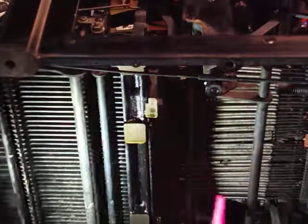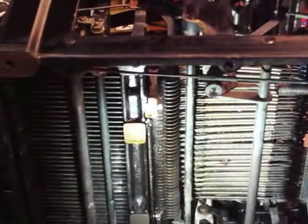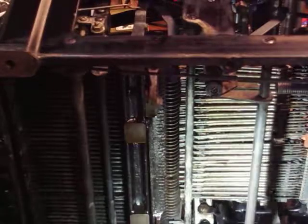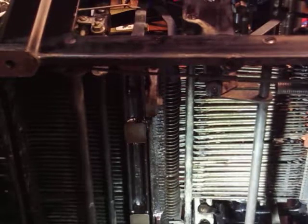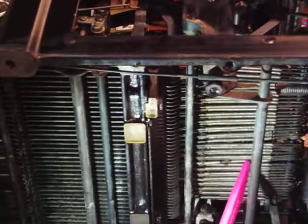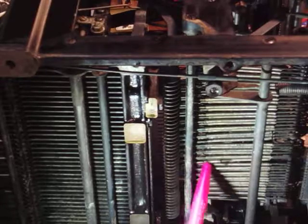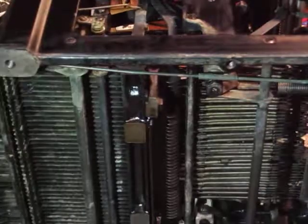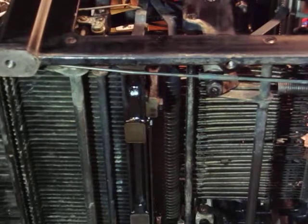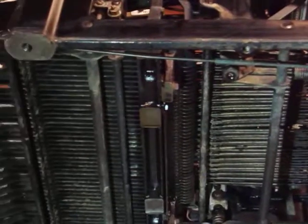What I've done basically is give the body back to the return on the number five key. I could have pulled it more, but it's returning — that's the whole point. If you have one of these that's broken, it's not the end of the world. You may have to go a little further up with it and stretch it and hook it on. You can give that body back to it and still reuse the broken spring in the machine, rather than trying to muster something else up.